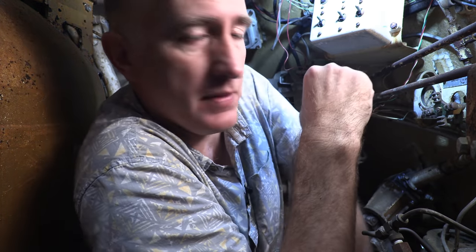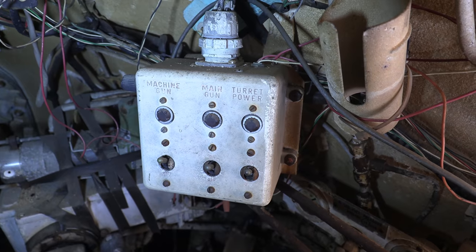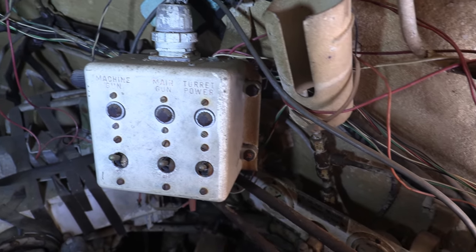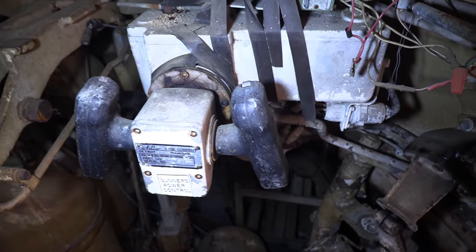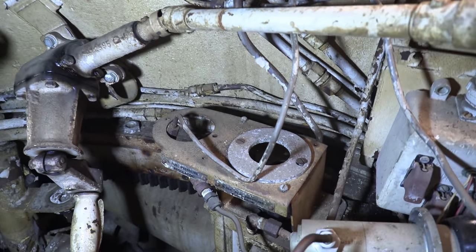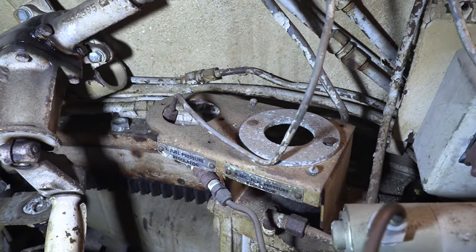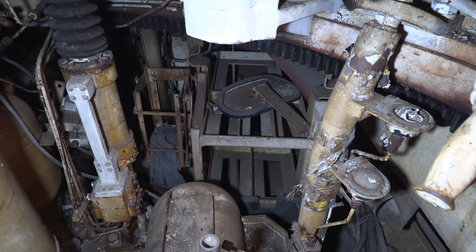Total firing time was about 60 seconds give or take for a full load. Going around: fuel, air pressure, 10-second fuel pressure — you've got your selector switch between machine gun, main gun, and turret power. Coming forward you've got your traditional Cadillac drives — no surprises there — and manual traverse, with manual elevation under here on the left. There's a fuel pressure regulator, and then forward you're going to see where the 90mm ammo would ordinarily go, plus stowage for 7.62. That's basically it for the turret.